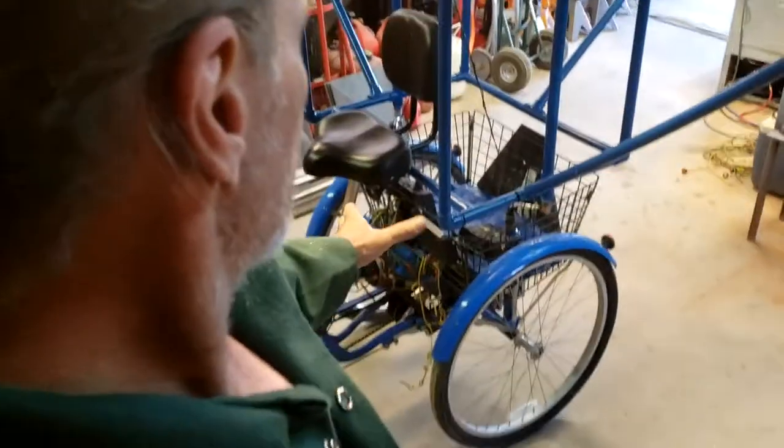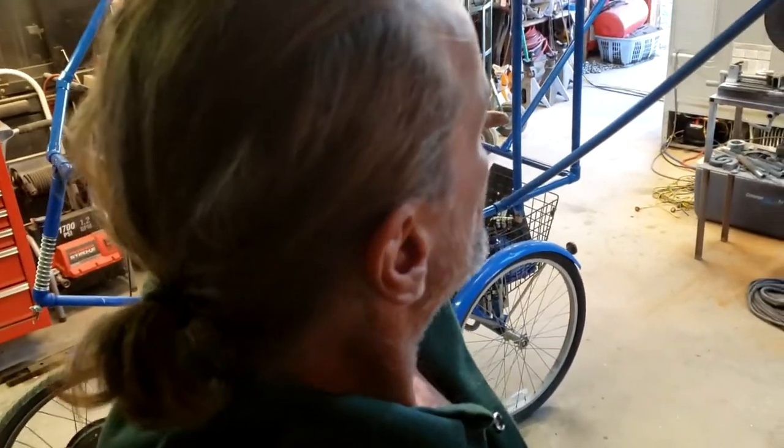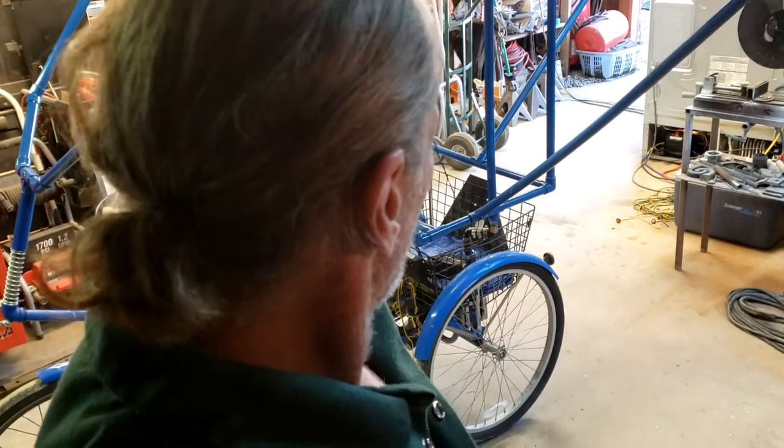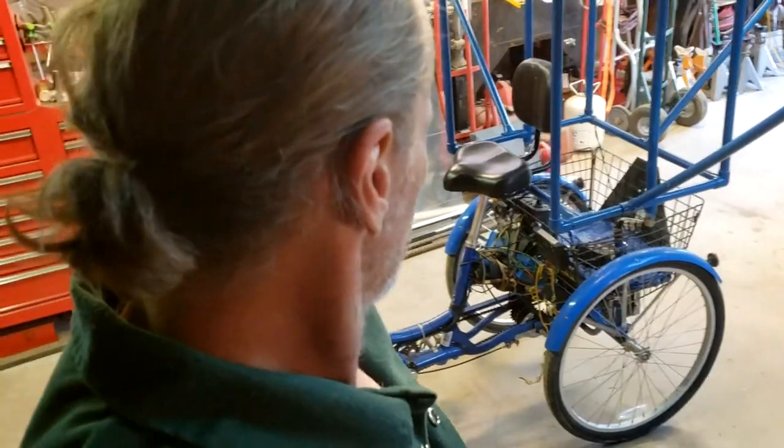Anyway, that's my intent. And then the sweet part of that is that I'm still going to be able to retain all my 12 volt features, and it'll be a true auxiliary backup. And I'll gain the efficiency of the 48 volt system going straight into the, you know, I'll be able to run off the sun directly. And I'll have my 110 volt. So I'm going to have the best of everything, looks like. And I'll still be able to do my shows. And I've got a little bit better cargo space now, it looks like. Everything's going to be better.